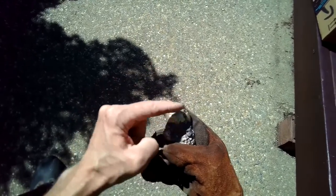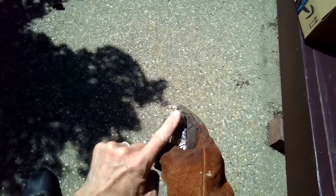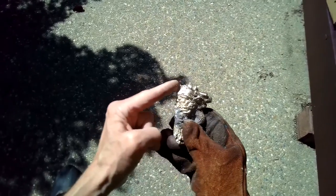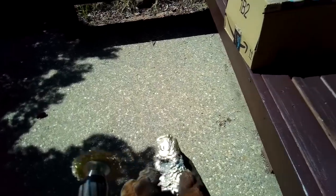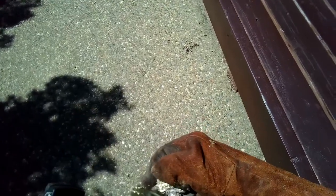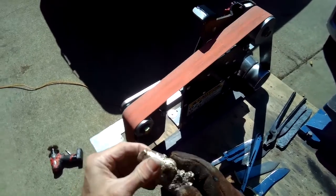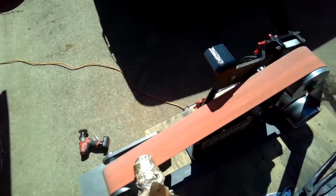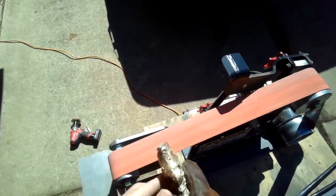I'm going to cut this little extra piece off with a hacksaw, grind that off, grind everything nice and flat. I think this will be workable. I'm going to grind off some of these seam parts too. Then I'll do a little shaping using a pretty aggressive belt. It's working on the basic shape.